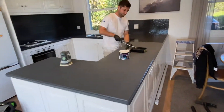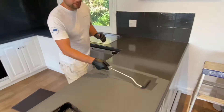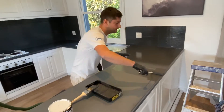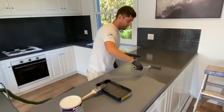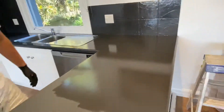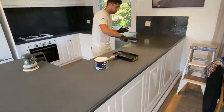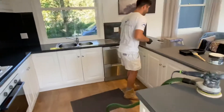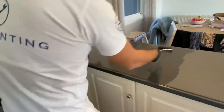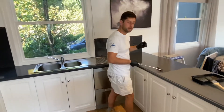Check it out — this is how it's applied. I'm using a special four millimeter microfiber short nap roller, and that is what ensures a really smooth finish. That's a must because it's a flat surface, it's a big area, and it needs to be super uniform. I'm applying it on nice and thick. I like to go in cross sections — going this way first applying it on, then working in a vertical motion for the final run. This blends it in, and I'm working with the light of the room for a better finish.